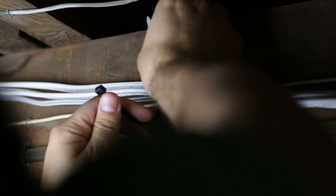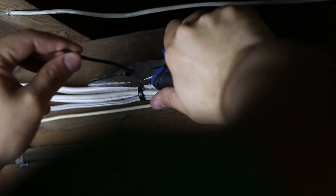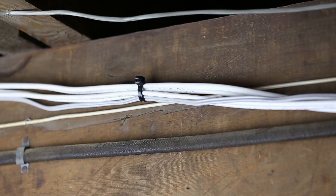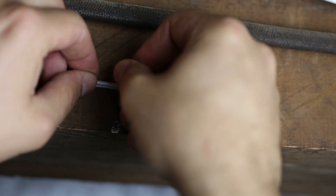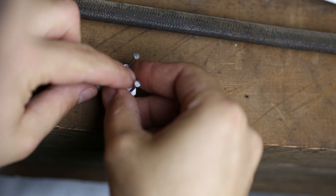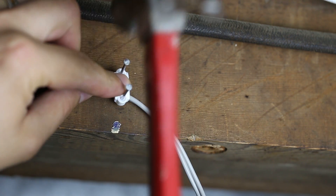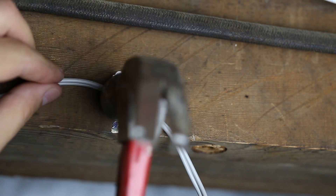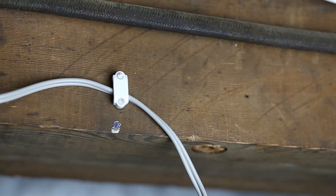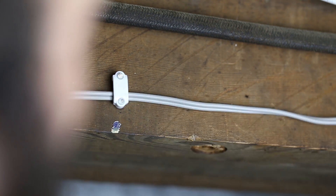If you run cabling over pre-existing wiring, try tie-wrapping your camera cable to the wiring. Wrap cables every 2 to 3 feet. Conduit is a great option to protect and conceal your wiring. If conduit is not an option, affix the wiring flush against the surface with a cable bracket. Cables installed outdoors should always be installed in watertight conduit to protect them from the elements. After you have prepared the cabling, you're ready to install your cameras.